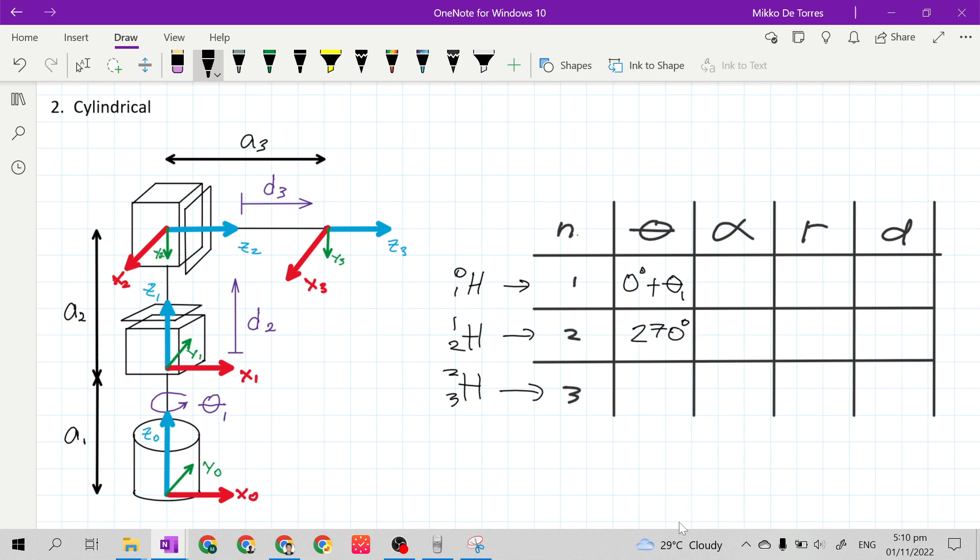You don't need to add anything because this joint is a prismatic joint — you don't need to add a theta. Next, for frame 2 and frame 3, our Z sub n-1 is Z sub 2, X sub n-1 is X sub 2, and X sub n is X sub 3. We will make X sub 2 have the same direction with X sub 3, but they already have the same direction, so our theta here is 0 degrees. There is nothing to add because joint 3 is a prismatic joint with no joint variable theta.